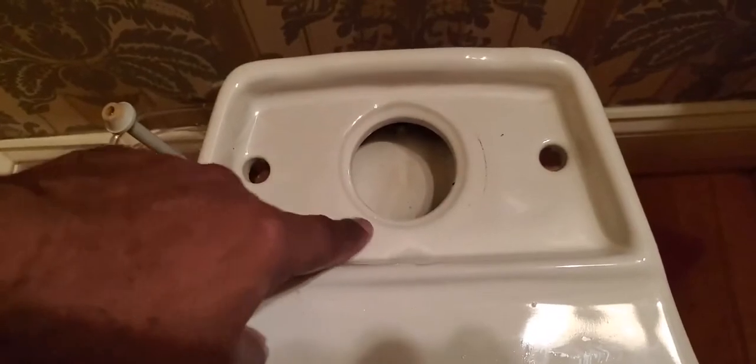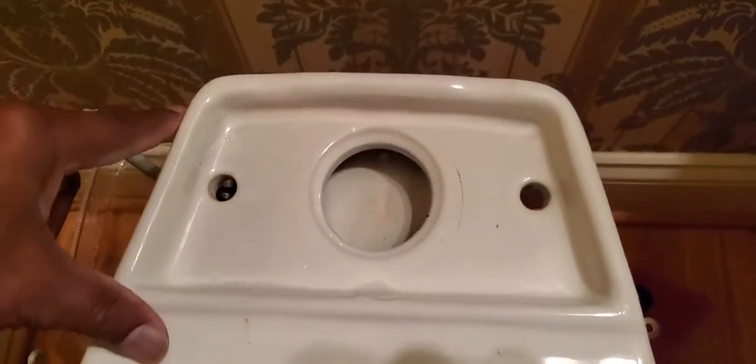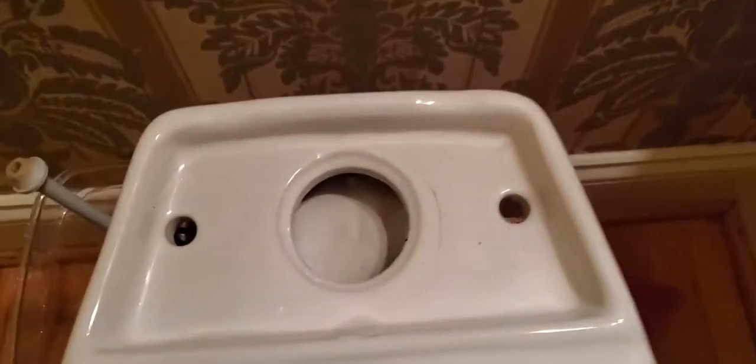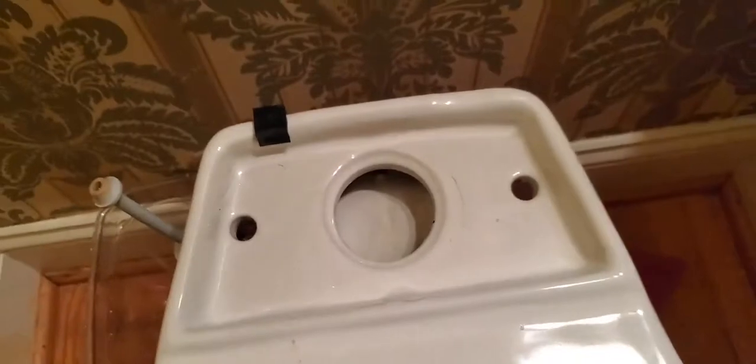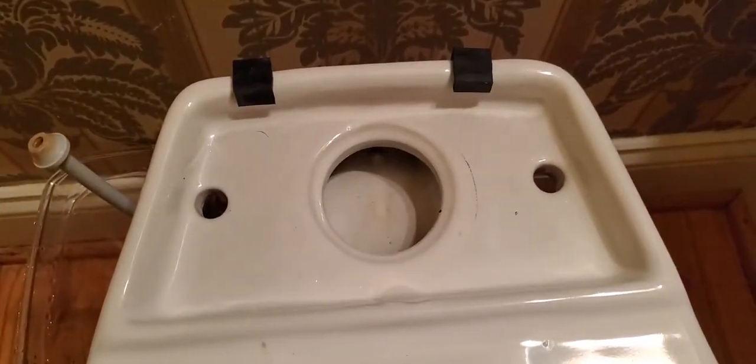The rocking tells me that the seal in here is not touching that hole at all. I found this out because I tightened everything up, connected the water back, the supply water filled it up, and when I flushed, water goes through and fills up that cavity. If I'm not seated on this properly, water is going to come around here, overflow, and you'll see leaking from different places.